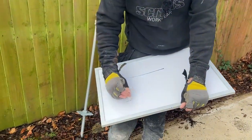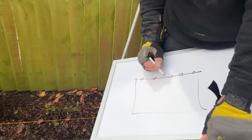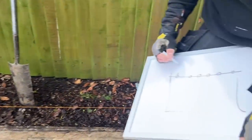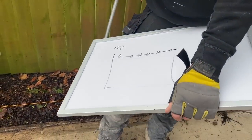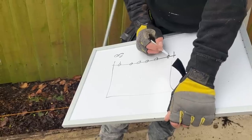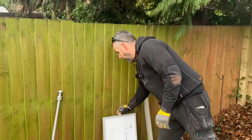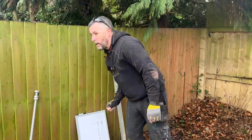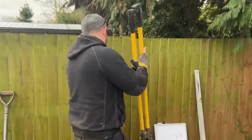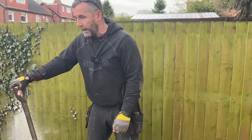There's your back wall and front sides. We have six holes — that distance between the first hole and that corner is approximately 200mm, these are then evenly spaced, and that distance between that hole and the far corner will also be 200mm. We don't go more than 1.2 metres apart — nothing more than 1.2, closer the better. For a five metre build, six on the back. If the build pack says different, go with the build pack.